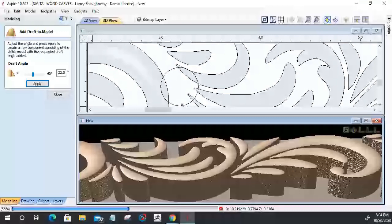But absolutely, if you're doing something like a VCarve and you do not raise that bit up to move from one place to another, you're cutting a V groove right across your board. So I do not encourage that. With a 3D model cut, you can have it where it doesn't raise up at the beginning or the end of the line.